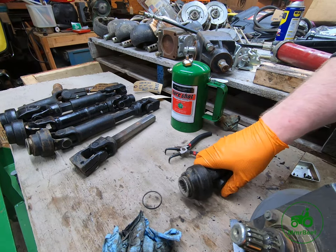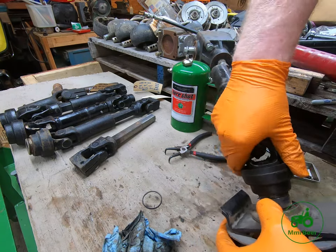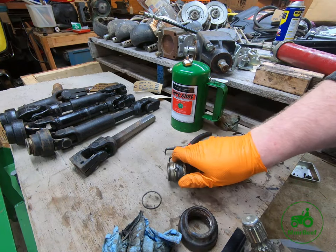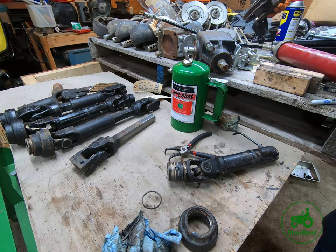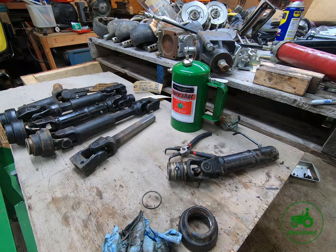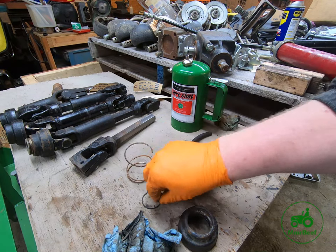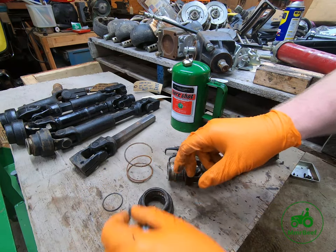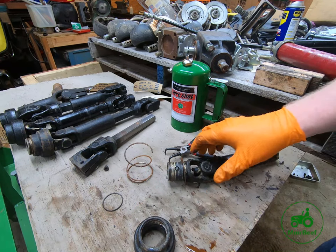Instead of fighting with it, you can walk over to a tractor, put it on the tractor, and that should release it if you pull it back just a little bit. I forgot the spring wasn't on there, but that's part of the fun of making these videos — you can see my mistakes. I've only lost a spring, which isn't bad. So you've got your spring, your retaining clip, your cap, and then there's a washer that sits on there.